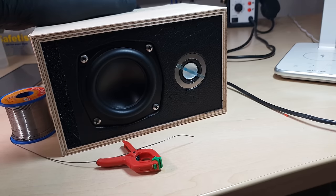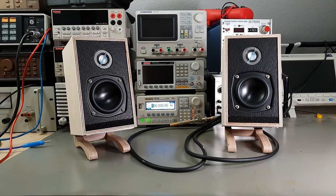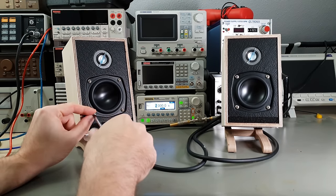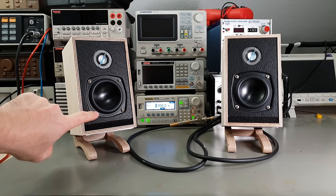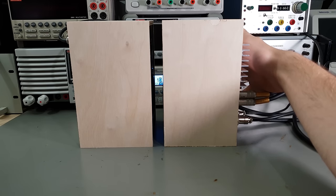A few audio files for testing are linked in the manual — MP3s, not guys with $5,000 silk-shrouded power cords. But rather than MP3 files, I'll use a signal generator because it looks so much more professional. A low-frequency sweep lets you detect a leaky cabinet, as can be simulated with a missing screw — my camera doesn't seem to pick it up, but it's a clearly audible huffing sound. You can also send equal signals to both speakers; if you phase-shift one by 180 degrees while the speakers face each other, you should observe cancellation. If not, you may have made a polarity mistake somewhere. If yes, you can use this to run in the drivers quietly overnight.